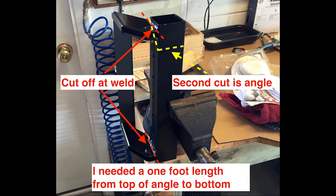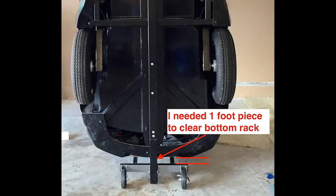The main frame tube that runs from the front to the rear under your trailer should end at a 45-degree angle several inches back from the lower or back part of your trailer. Match that angle with the cut that you'll need to make. Be sure that the pre-drilled holes will run from side to side in your finished product. On the flange you are about to cut, measure one more time to be sure the length you are cutting will keep the trailer plastic or the bottom end from touching the frame.